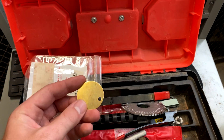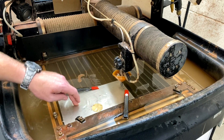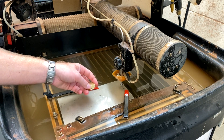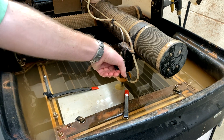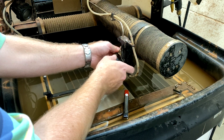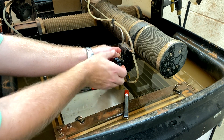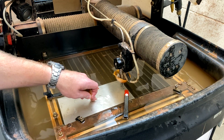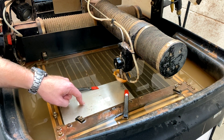There will also be a little disc that we use to measure the Z-axis. As we can see, the material is not moving anymore. Grab the disc and go underneath. Adjusting the Z is manual — come in here, loosen it up, and you can pull the Z-axis up and down as needed. Once set, righty-tighty to lock it, then pull the disc out. The offset is set and the material is in. All we need to do now is jump on the computer and set the directions for the cuts.